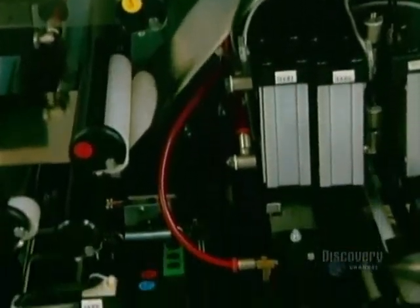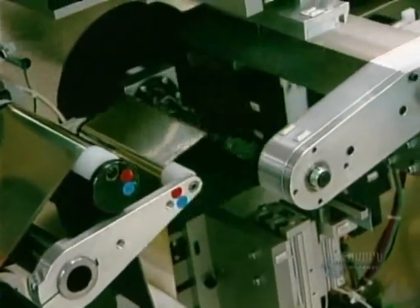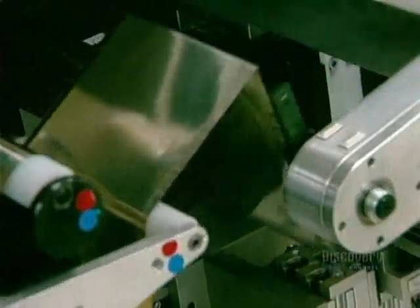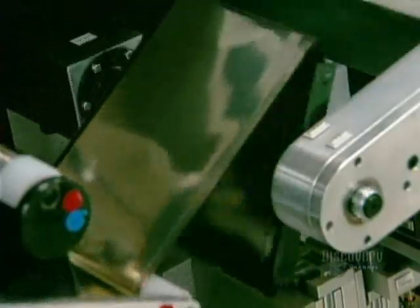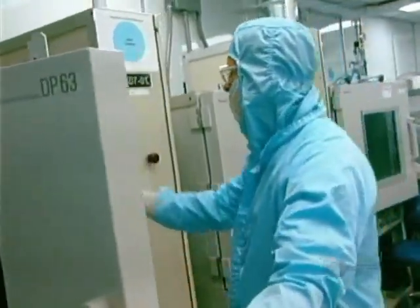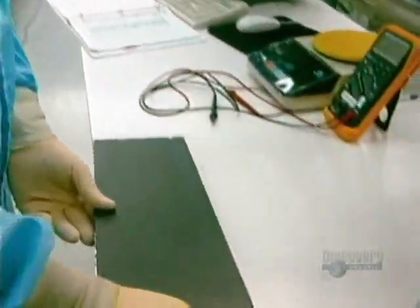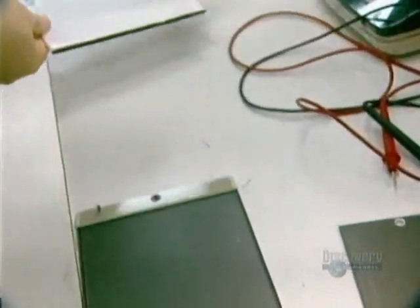The sheet will be used to make individual battery cells. These cells will be assembled in series and in parallel and inserted into modules of different shapes. To make an individual battery cell, the sheet has to be rolled up. This automated spooling machine winds up the lithium film in 26 revolutions. The wound-up sheet is then put into a vacuum oven where the various layers adhere firmly to one another. This step lasts for about 90 minutes at 80 degrees centigrade.